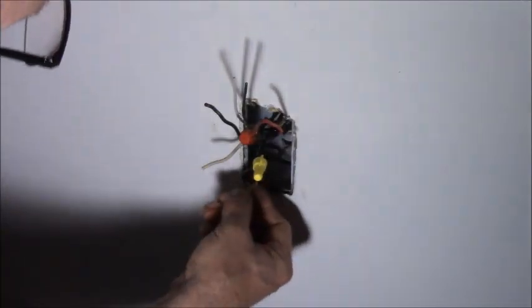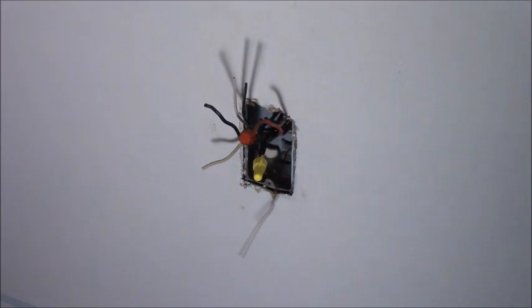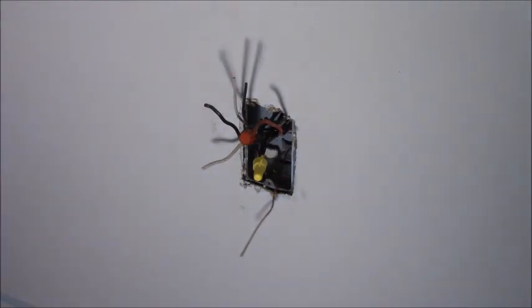I probably can ground this box. There's another wire in here somewhere. Oh, it is. It does have a ground clip on it. Oh, well, it's just double grounded now. That ground goes over there, so I'm just going to let this ground the box. I'm going to snip it off. I'm just going to use this ground that goes over to the other box. Okay, so they're both grounded in the circuit in different ways.